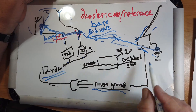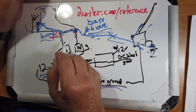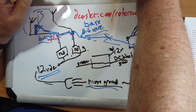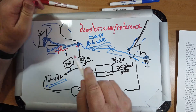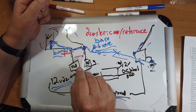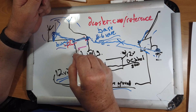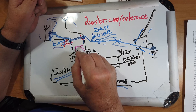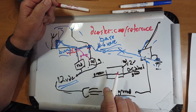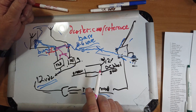That is what is so important — that you keep everything together. Now, here in the shack, you really need to have a single point ground. My single point ground is a simple one-foot copper bar or copper pipe, and the grounds from everything inside come to that, and then this comes out to the ground rod. Now, if you bond that over there, you don't have to bring it to both places.